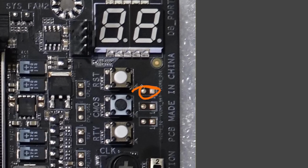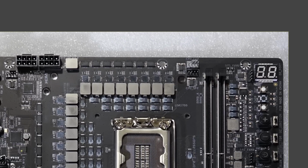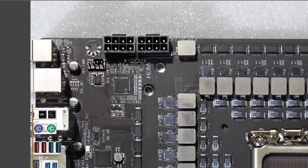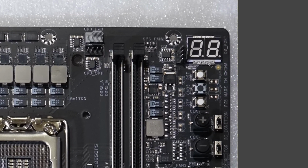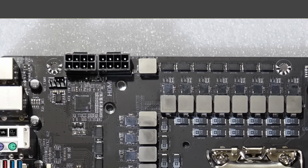And this is kind of fiddly to implement, because the die sense circuitry is very sensitive. So you can't just run wires from your voltage read point to the die sense circuitry. That would be a very bad idea, as you would potentially introduce all kinds of noise getting picked up and fed into the die sense circuitry, which would make the VRM controller very sad. Potentially, not necessarily always. I've stabbed die sense with a multimeter in the past. You shouldn't do that, but on motherboards where you don't have a dedicated die sense voltage read point, that's kind of the easiest way to do it, and you just gotta hope that things work out.